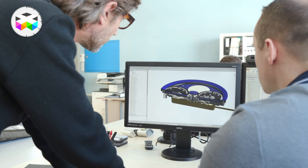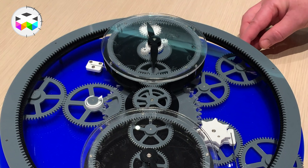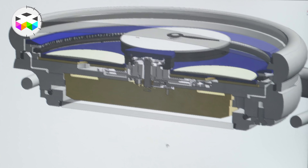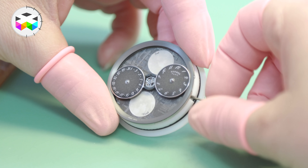Let's find out with Jean-François Mojon, founder of Chronode, with whom Hermès had the very good idea of collaborating to develop this timepiece. He explains: first, all the indications have to pass through the center — coming from the base movement, going through the center, then redirected to the sub-dial for date, hours, and minutes. Second, everything has to be reduced in height so it's not too thick — that's also a major challenge. And corrections must be possible for hours, minutes, date, and moon all together.